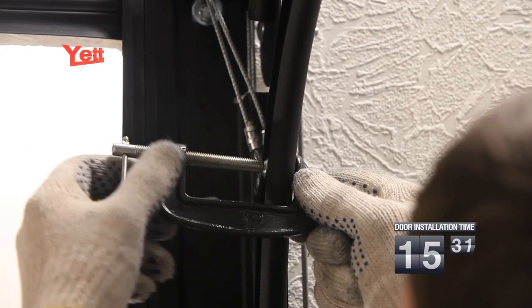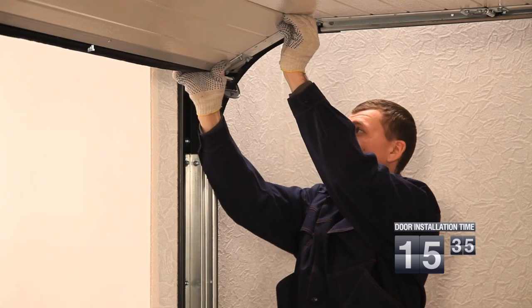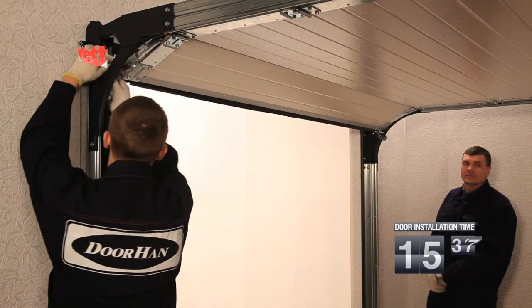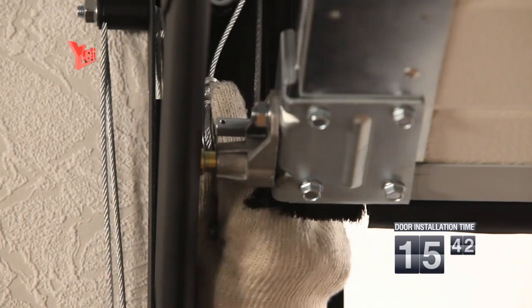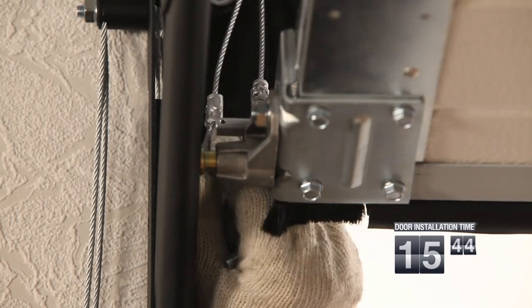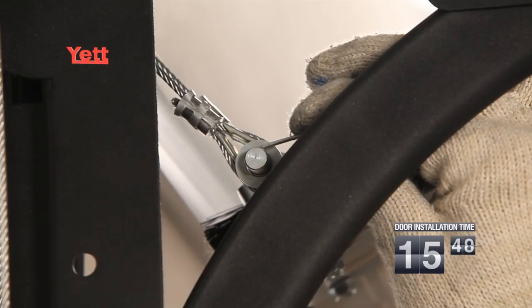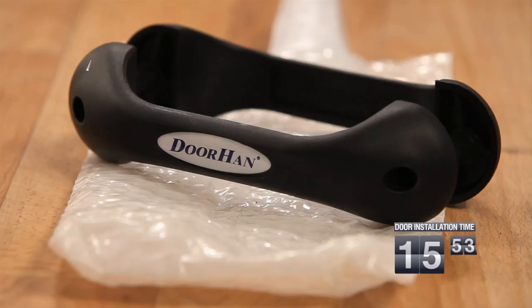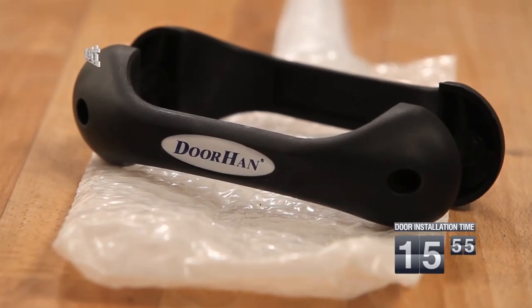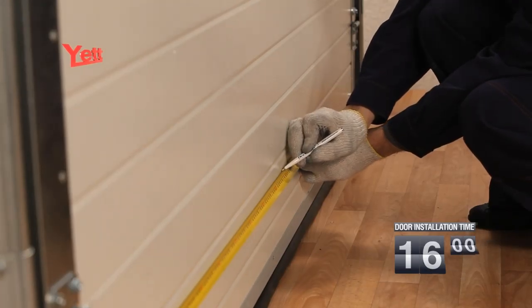For this purpose, after pressing the gate leaf, it's necessary to lift the gate in an open position and to fix it, preventing falling. As the balancing adjustment mechanism of the gate leaf is assembled together with the vertical rack, it is necessary to uncouple a pull rope with the transport screw. A thimble is fixed to a special fixture of the bottom lateral buttress pier by means of a washer kit and a split pin. The standard complete set of the gate includes the handle intended for convenient opening of the gates.